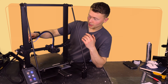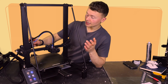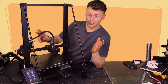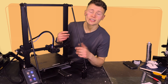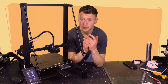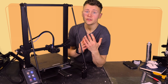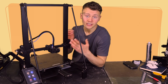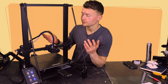The final con is that you can't adjust the extruder tension — it's fixed. It has performed very well, and I've only been printing with PLA, but for some materials it's recommended to tweak extruder tension, so it would have been nice to have that flexibility. That said, for first-time users, a fixed and well-set tension means one less thing to worry about.